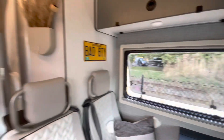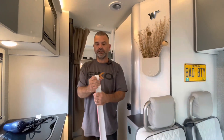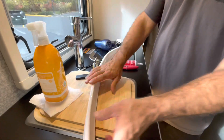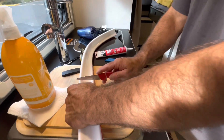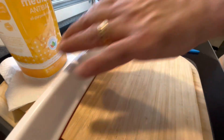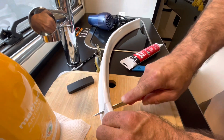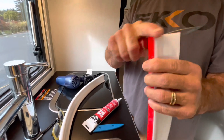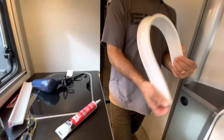Our surface is pre-cleaned and the product is warm and flexible. I locate my mark, place it on a cutting board, and use the knife - an exacto knife or whatever you're comfortable with. I'm going to score straight down my pen line. Some folks might use a straight edge for a perfect line, but I'm comfortable making a straight cut. Starting at the top, I make a clean incision - you can see that cut is very clean. Set the extra piece aside and reinstall the knife guard.